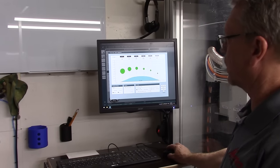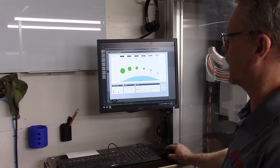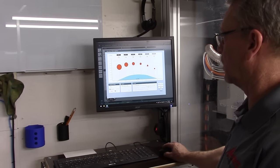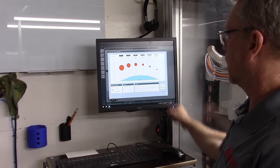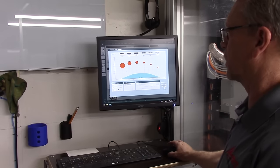Now this is the action that we wanted, but again, it's not going to be accurate only because the saddle's not set yet. If we did set it and remeasured it, then we could see where it is. All of this is at the 12th fret, so the saddle height is causing it to be higher than we wanted, but you can see it's a pretty good curve following the fretboard, so we know that's right, and if we just adjust the saddle, this will turn out good.